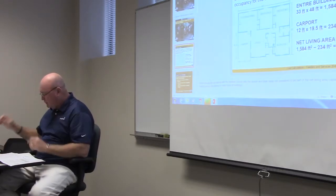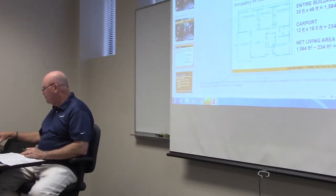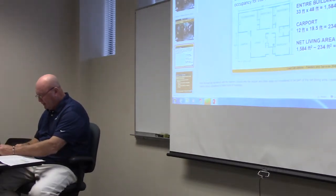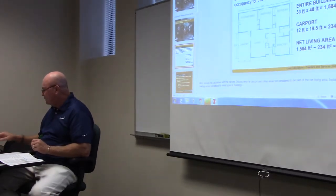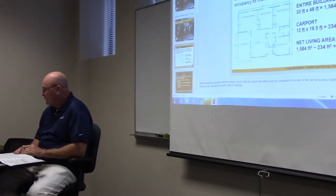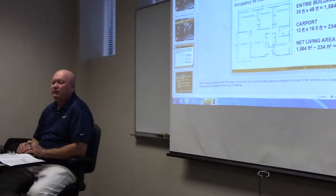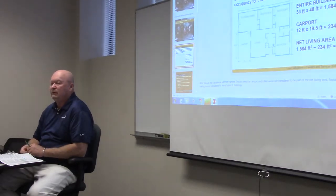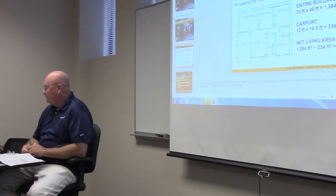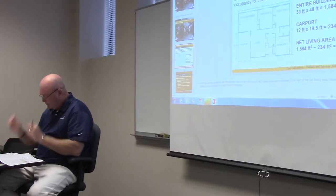All right, the range table in the NEC is found where? Table 220.55. We've looked at that, there's a table in our code book. The range is based on the size of the range. It's how you calculate range KW. And with each number of appliances, you can derate when you have more than one. So it gives you a summation of the range table there.